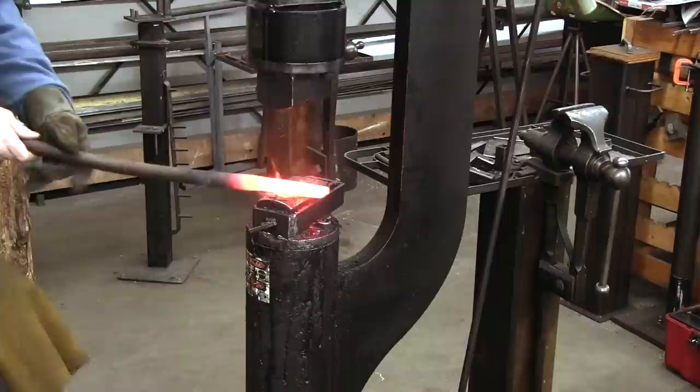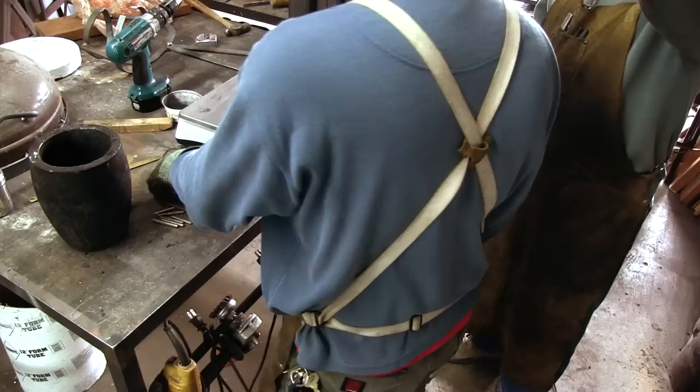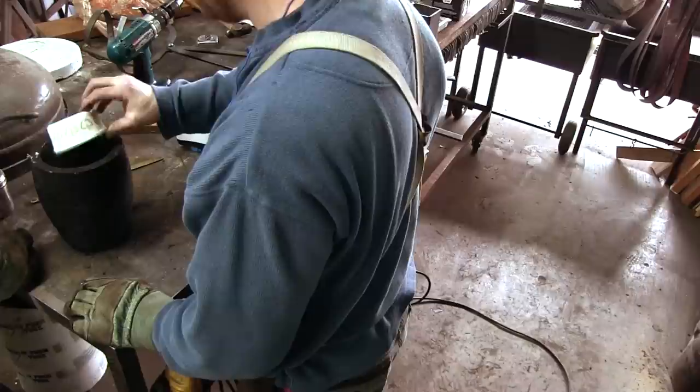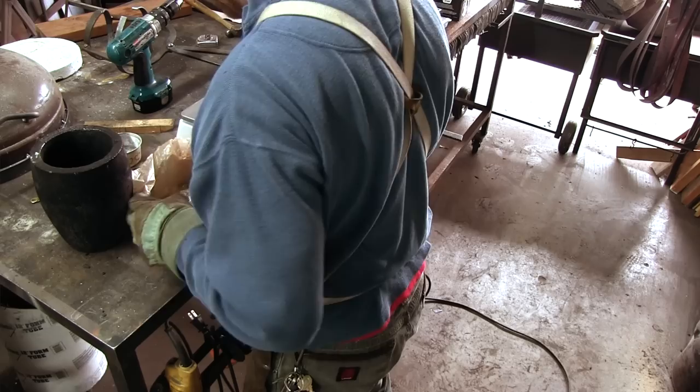This is our first experiment with a furnace that is meant to reach temperatures up to 3000 degrees Fahrenheit, which is sufficient for melting wrought iron. We charge the crucible with approximately 1130 grams of wrought iron and 17 grams of pulverized charcoal. Crushed glass is used as a flux.